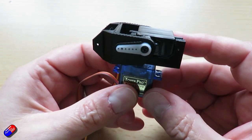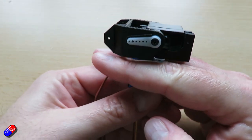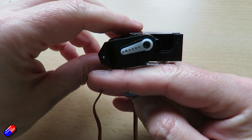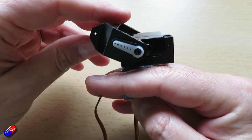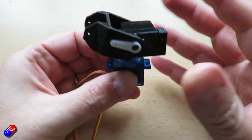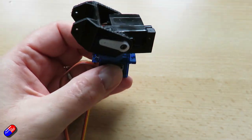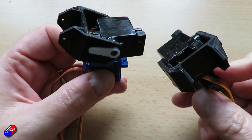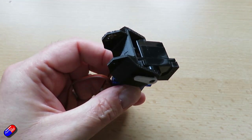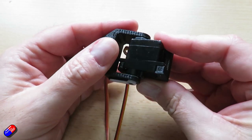And finally this is the final version. The idea is that this will sit in your model so it can fit pretty flat — there's not an awful lot outside. For this low profile version the look down is limited but you can look up and obviously side to side. You just need two standard nine gram servos. I've actually made two of these. It's a 19 millimeter camera mount at the moment, but if you go into Thingiverse and want me to change the width for the particular camera you have, I'm quite happy to do that.